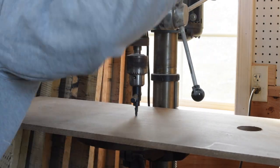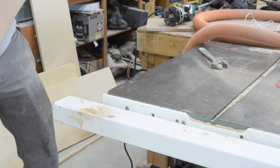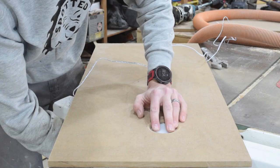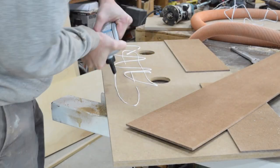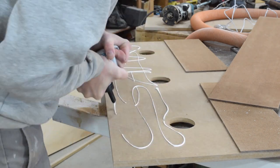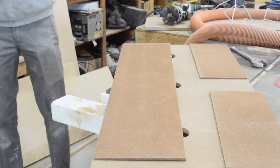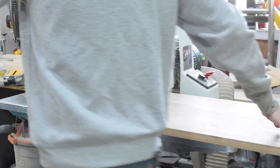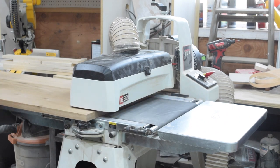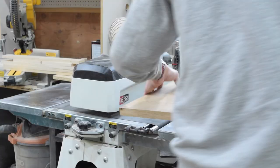To do that, I'm going to make a false panel for underneath that cabinet, and using a custom circle cutter I'll cut out room for those puck lights. Then I'll add just a little bit of blocking and backing to offset that panel just enough to run the wiring for the lights. Those puck lights are the new thing I really want to try with this project.